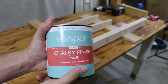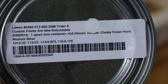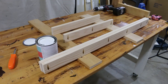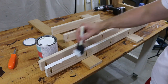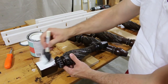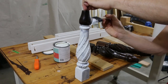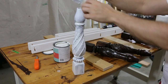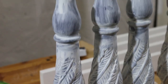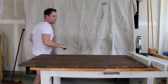I'm using Valspar's chalky finish paint — this stuff's expensive. I used to make my own chalk paint, not to be confused with chalkboard paint. What I was making was calcium carbonate powder, water, and acrylic craft paint. The benefit is it gives a nice milky chalky finish over existing finishes — perfect for covering these reused legs and apron. It goes on really nicely with a smooth even finish. I always sand between coats. Painting is literally the worst thing ever — well, bowling kind of sucks too, that's why they sell beer at bowling alleys.